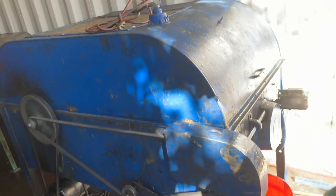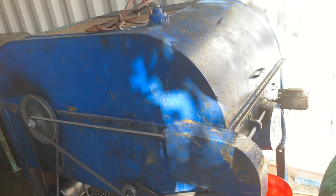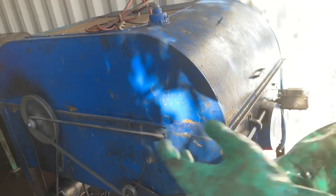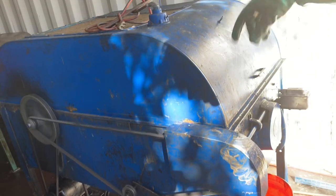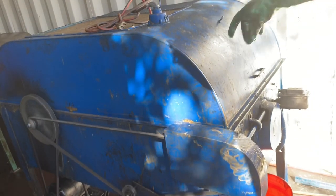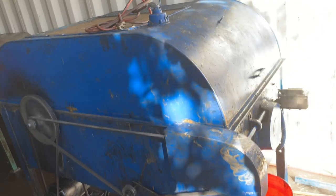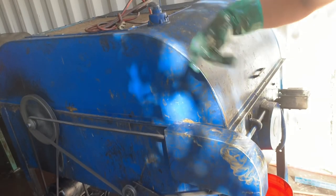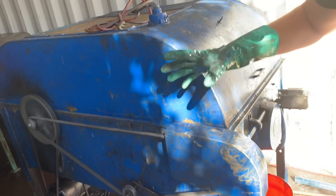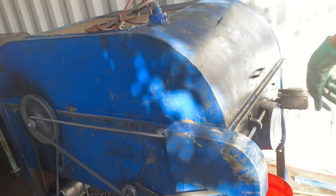Also, when you cut really long stones, eventually you'll notice where your feed is worn out. This saw, the feed is actually a little more worn out at the front than it is the middle and the back, because the cuts have started there the most. So sometimes if I set it too far back, it actually struggles to get started. All right, so I can hear it just tickling the rock. When it starts to hit it on the full rotation, in about another 5 seconds, there we go, sound's changing.